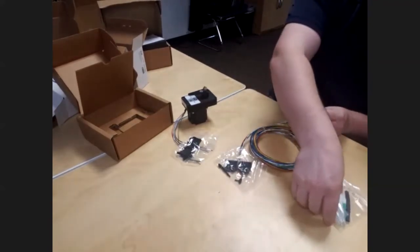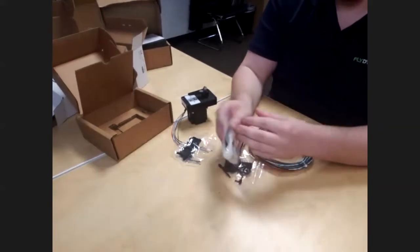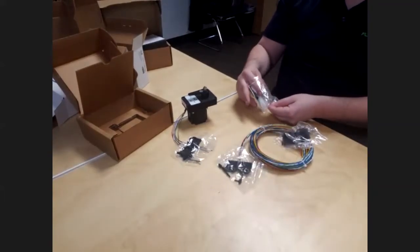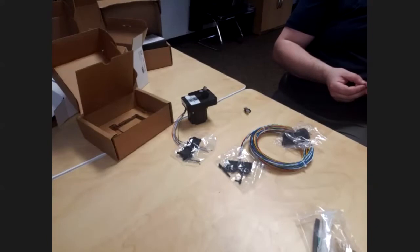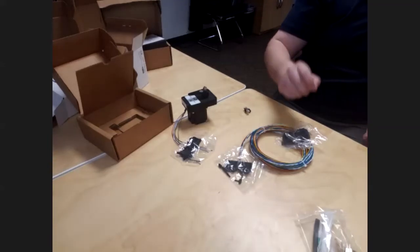And the one thing that's slightly different about the servos is they do use SkyView network, and that's for the data connection. But SkyView network is fundamentally a low amount of current. So the ADAHRS and the engine monitor module and the AirLink module, those are all relatively low power devices. The servos are pulling amps though, right? They can control your control surface.